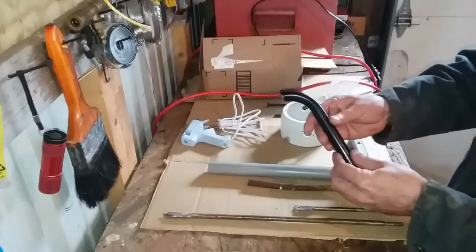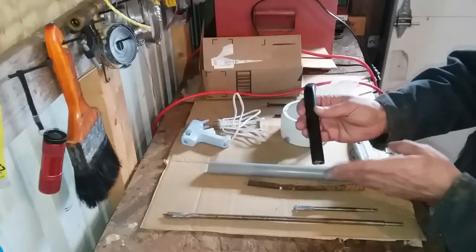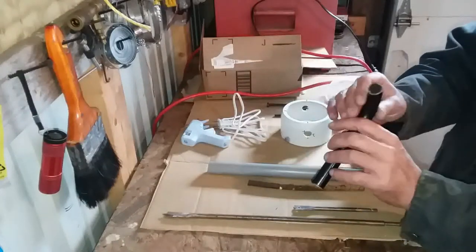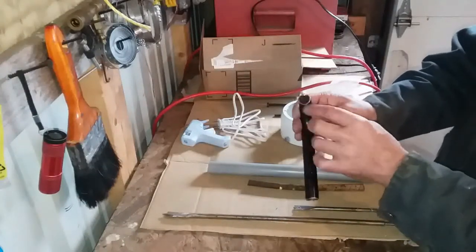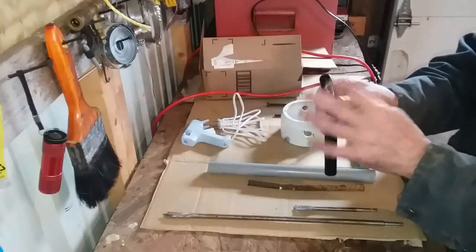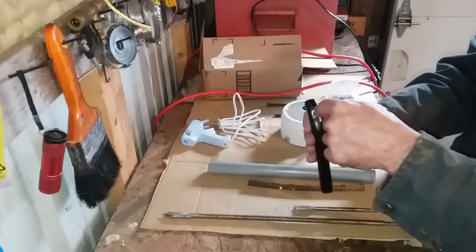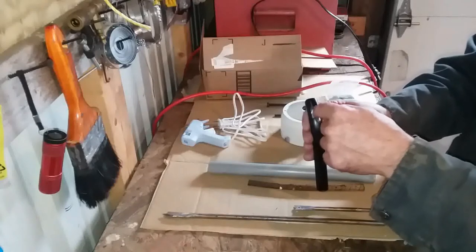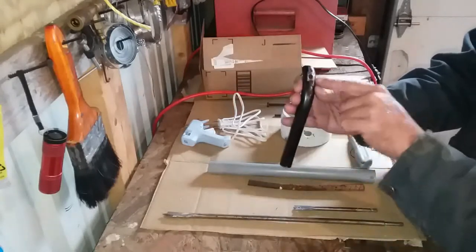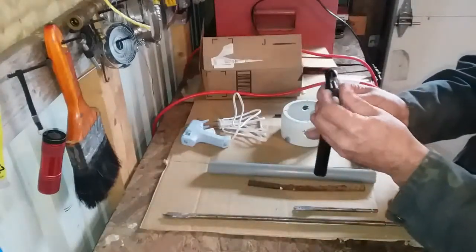But anyway, I took this pipe that you saw earlier. I cut the bottom off smooth with a cut wheel on a 4.5-inch grinder. And I cut this vertical and even put a tiny little notch in it that you probably can't see, but it's there. And I drilled a hole. Now the trick to this hole is you drill downward with your drill, and you use an older bit, so if it breaks, you don't care. And then as you're running it, you slowly angle it upwards, and it makes these little notches so that your quarter inch bolt that holds this in place sits level.